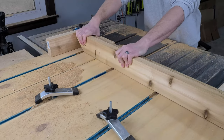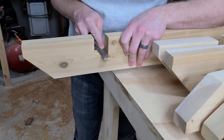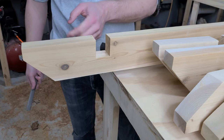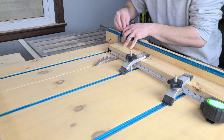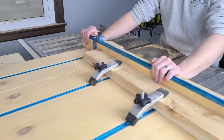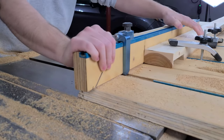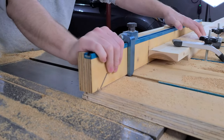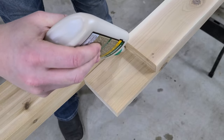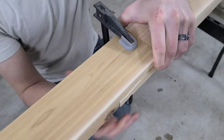Quick tip: if you're using a thin kerf blade, your blade won't be an eighth of an inch thick, so you'll need to adjust accordingly. If you have a flat ground tooth saw blade, your cut will already be pretty clean. Otherwise, you'll have to come back with a chisel and clean up the cut to flatten it out. Since we are making the tomato trellis longer than a single board length, we need a way to join the two boards together. We use the same setup to create a half lap splice — just set the stop block and cut all the way to the end of the board. Make sure you use an exterior rated glue like Titebond 3 since these will be outside. We certainly don't want to make that mistake again like we did with our planter box.